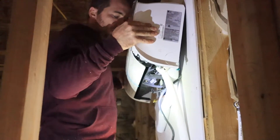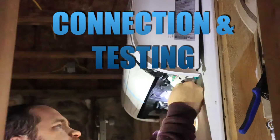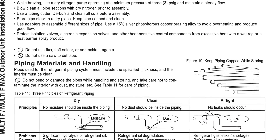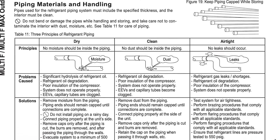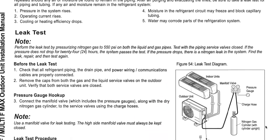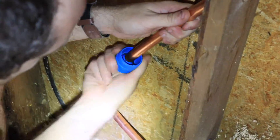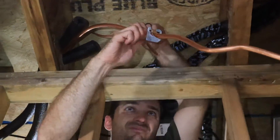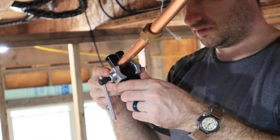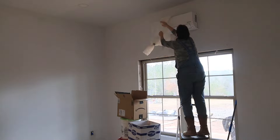Before we put sheetrock up, we knew we had copper joints we'd done ourselves, so we wanted to get the lines tested before everything got sealed up. We had a professional put the system under a vacuum, and sure enough there were a few leaks on some of our joints — probably a cheap tool or just not knowing what we were doing. He found the leaks, redid the joints, and we got it to hold pressure. At that point they filled in the refrigerant, started the system up, and it worked great the first time.